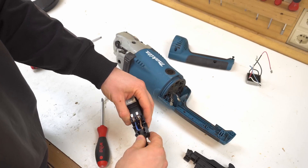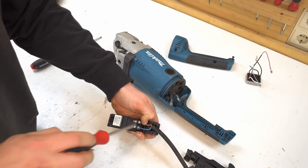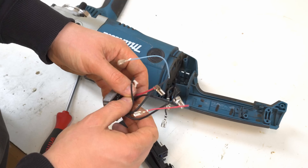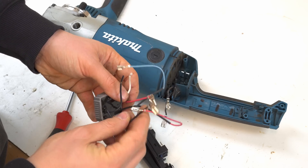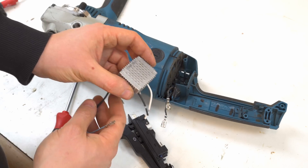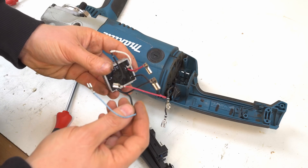And this is installing the power cord and the strain relief to the new switch. The two thin wires of the soft starter connect directly to mains and neutral, and the short ones with the spade connectors connect to the switch, and the bare ones connect to the motor.